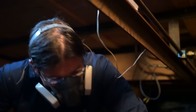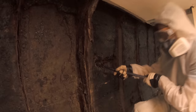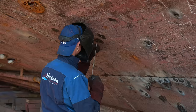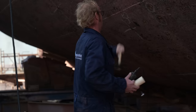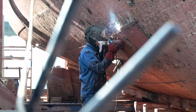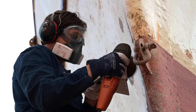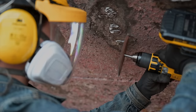So far we ripped out all the interior from the saloon, underneath the aft cabin and in the fo'c'sle, and removed a lot of dusty old cork insulation together with some frames. After that the lads from the yard repaired the very big electrolysis damage. We called in an expert who discovered a very big hole, but we decided to continue this project anyway. While the shipyard was repairing the hole we continued with massive destruction and removing a tank from hell. Eventually we started de-rusting the waterline and preparing the hull for painting.